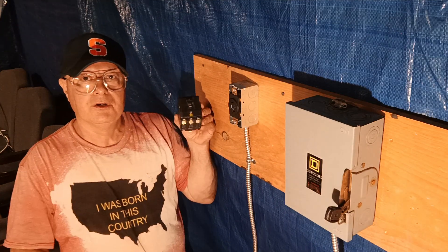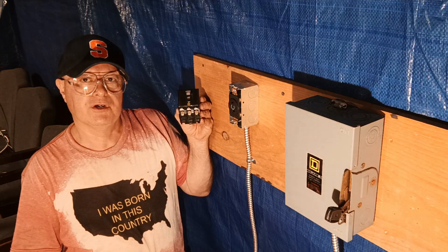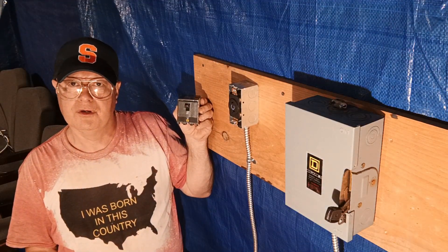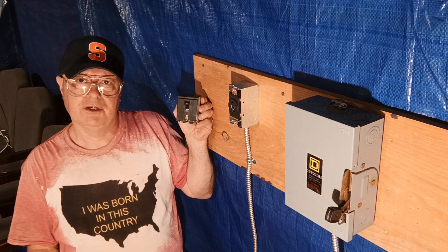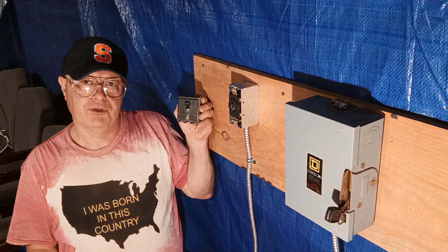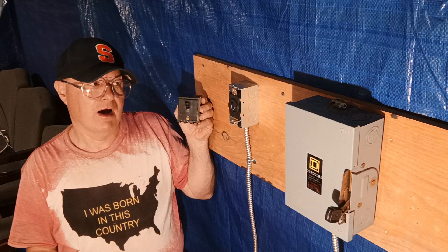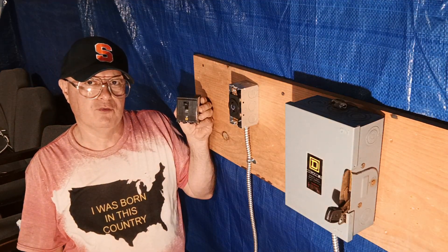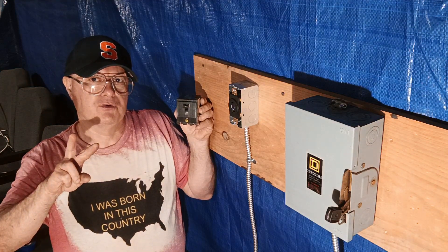If you're using a circuit breaker, put your three live wires under these three terminals — this is a three-pole breaker, Square D QO style. That is how to wire a three-phase 208 20-amp or 30-amp receptacle. The 30-amp wiring is the same but you use number 10 wire, and the spacing between terminals is a little different. This is the 20-amp version using number 12 wire. Thanks for watching.